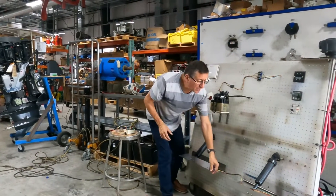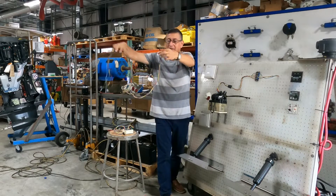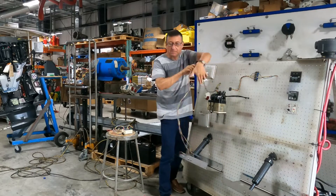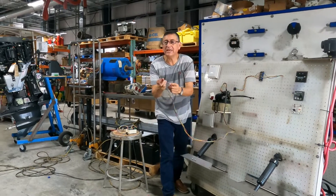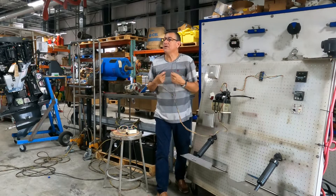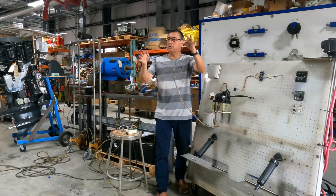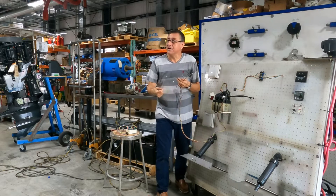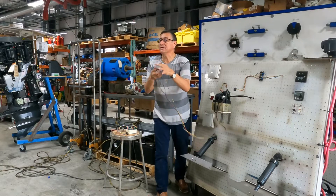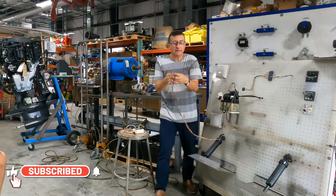I love it when you visit a marina and find that garbage on the green can — try to get one of those harnesses. I disconnect the original harness and connect my salvaged harness, and now I have those cables free to check up and down by myself and verify what the problem is. I have red and green for the solenoids and blue and yellow for the motor. With alligator cables and power positive, I can operate everything. I eliminate the console and now I have the cables ready.